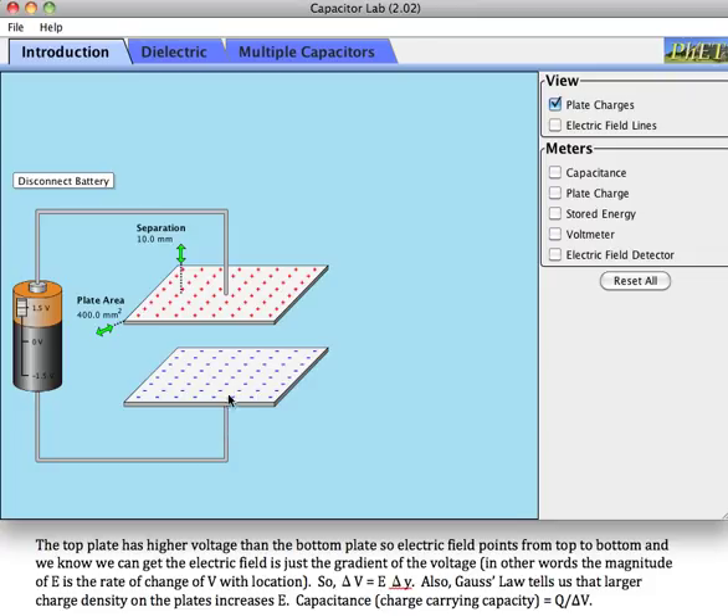Where are the electrons? They're all here on this plate. The tiny little wire is a conductor, and the giant plate is a conductor. When you spit electrons onto this conductor — made up of the tiny little wire and the giant plate — the electrons spread out away from each other, so essentially all of them end up on this plate. Similarly, the reaction in the battery gobbled up electrons from the top, so almost all of the positive charge that's left behind is on this giant plate. So you have a positive plate and a negatively charged plate.